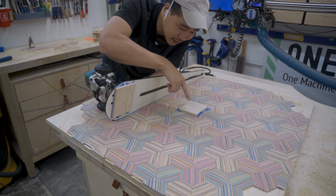I'm running into a little bit of an issue right now. The frame itself is about 1/4 inch bigger than the tabletop, so it's not fitting and it's kind of loose. There's really no good way to reference this off the fence to get a nice clean cut because everything's round. So what I'm thinking is I'm going to temporarily clamp the outer frame together and then use the track saw to cut a little bit off and keep doing that until it fits. That's the only best way that I could think of to salvage these.